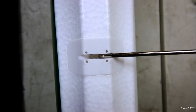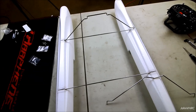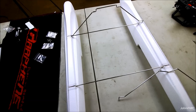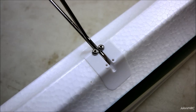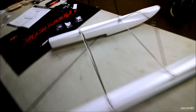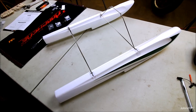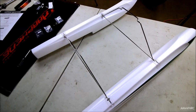For the floats, get them set on the table. You'll get these little spreader bars and if you look down in here you can see there are three kinds of holes. The spreader bars go on the farthest inside holes, and then your pieces go on the next holes over - front and rear, same deal. Once you get that in, put two screws in and you're good to go. Done - super easy. Just a screw on each side holds it in place, piece of cake all four corners. You use the self-tapping two-by-eight screws and it literally takes like two minutes.